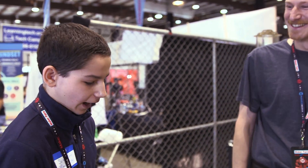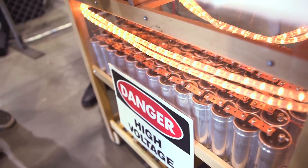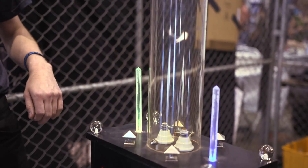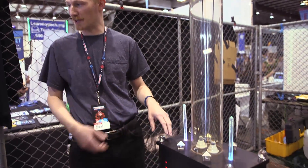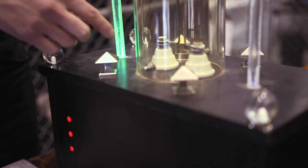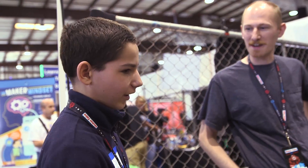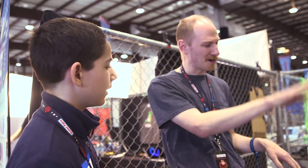Are you using flux capacitors for this? No, these are just regular capacitors — about 90 something in there, about 8 kilojoules if you take it all the way to the top. This over here is my dad's Jacob's ladder. Inside there's a high voltage transformer, a neon sign transformer, connected right across the two terminals. The high voltage breaks down the air and creates an electric arc, and the heat from the arc makes it rise. We turned it on its side and tipped it upside down and the arc doesn't go out.